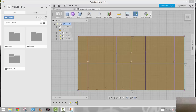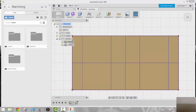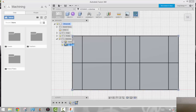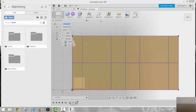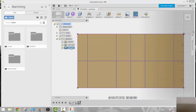The next thing I'm going to do is stop the sketch and go over to the tree and select the sketches. Sketch one was the bottom sketch where we made the rectangle and made it a solid. The second sketch is all these lines. I'm going to rename that to 'top lines.' Then I'm going to go to Sketch, create a new sketch, and select the same plane. I'll name this new sketch 'mounting holes.'